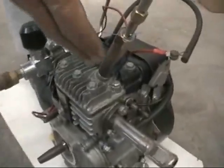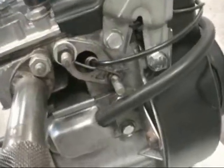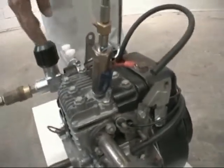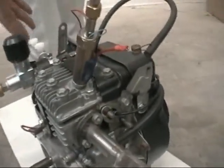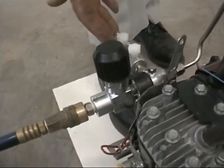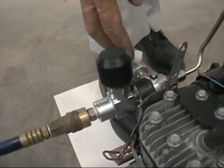Well, we're going to show, first of all, a mode of operation where we're bringing the hydrogen here, providing ignition only by the combination unit that could bring fuel if we choose. And we're also showing the ability to bring a number of different fuel sources. This could be running a combination through this mixer of any of the alternative fuels or conventional fuels or fuels such as terpenes that we'd produce by destructive distillation of citrus waste or some other.